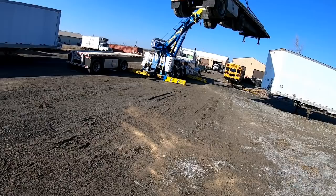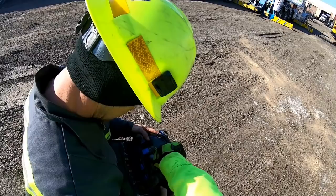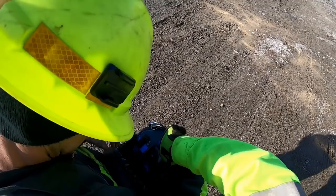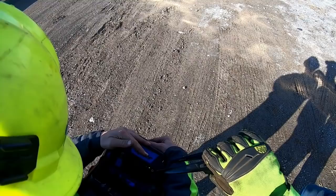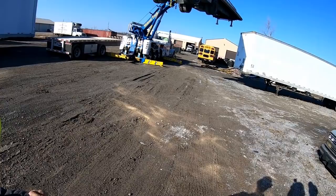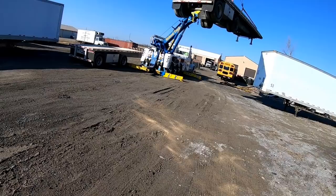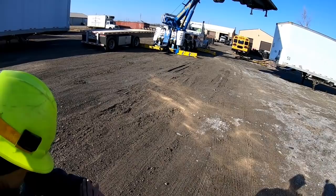Now, first, before you get any further, check your load screen. I know from running this truck that you're good, but you need to get in the habit of checking your load screen, the scales. Yeah. Just hit the scale. All right, what's it show? You're way down in the green. Hold on, I can't see. Yeah, you're only 32% capacity, so you're good. You're safe on tip and structure. Rollover and structure, you're good. Which I knew you would be, but you need to get used to reading that screen. Yep. Because if that graph ever gets up into the yellow, you need to rethink your strategy. Unless it's an absolutely, I can't do anything else, you know?